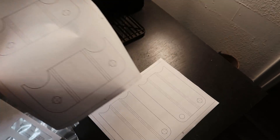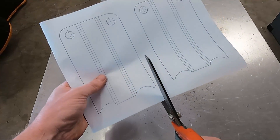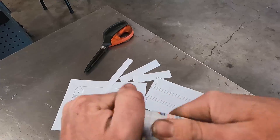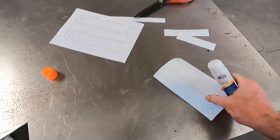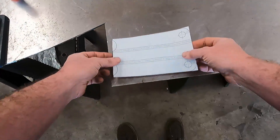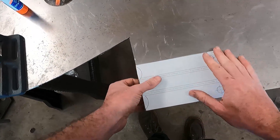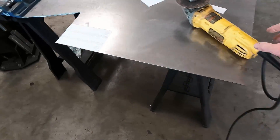It's a really powerful tool. We can print this drawing out at a one-to-one scale on printer paper and glue it to sheet metal, which is how we can make some really accurate parts really easily. Here's the actual printed diagram of our two parts. We're going to cut this stuff out and glue it down to the sheet metal — honestly Elmer's glue sticks are the best way I've found to do this. I've tried stick-down labels in the past but they always leave paper residue behind like a sticker that can't come off when you're done. This peels off every time.